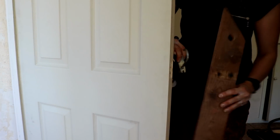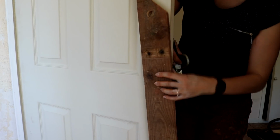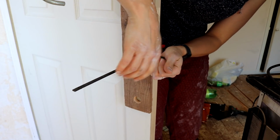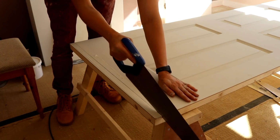But now for the spindle, I went for a slightly bigger one, a 15mm flat wood drill bit. But this time, because I didn't want to rip the other side, I clamped some old pallet wood to it. So when I drilled my spindle hole, it had no chance of doing that. So I'm happy I can say I've learnt my favourite method. Oh, miles better!